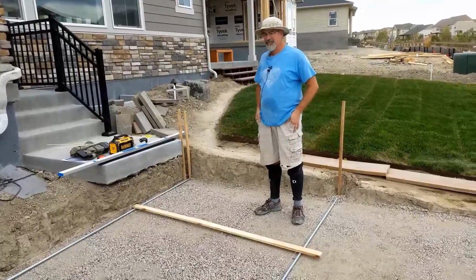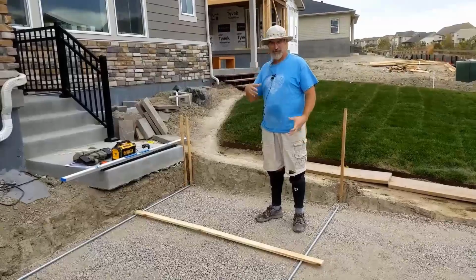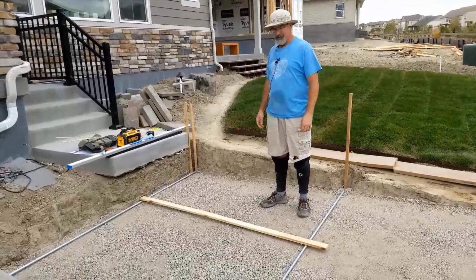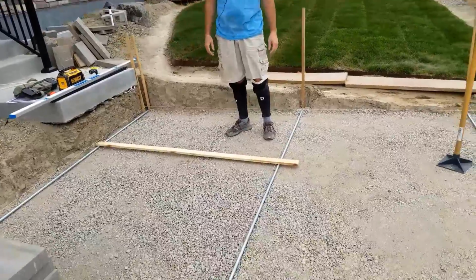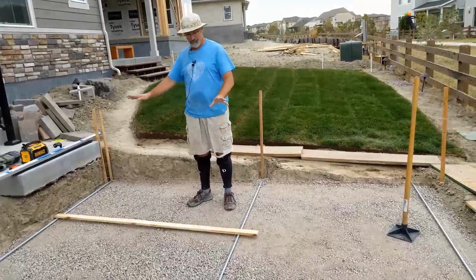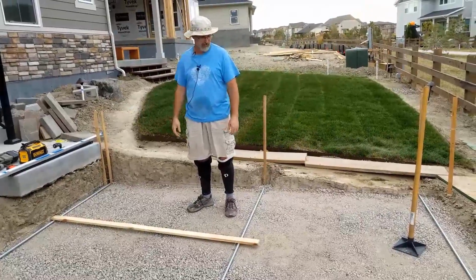And the PVC 1/2 inch is about that, but it's a little too flimsy for my taste. So I was trying to find something a little bit stiffer. And so I went around Home Depot in the conduit aisle, electrical conduit. I found some EMT 1/2 inch, 10-foot pieces that were about $3, so they're not too bad. So I got 3 of those, and we lined those up. And so we've measured from our string down to make sure that we're 3/4 inch up where we should be. So we got them all adjusted.